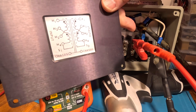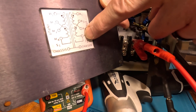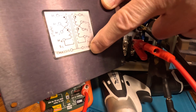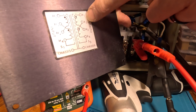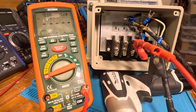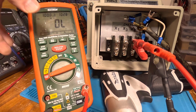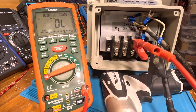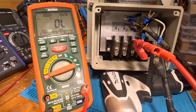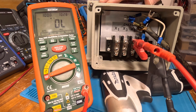Now we're checking the other coil. We just checked X3, and the screen is tied to it, so at the same time we're checking X3 and the screen to chassis. Now we're going to X2/X1 — we're checking that winding to chassis. I'm going to lock it and hit it. Okay, let's unlock it. Everything looks good on this side. I'm going to swing the transformer around to look at the other side.